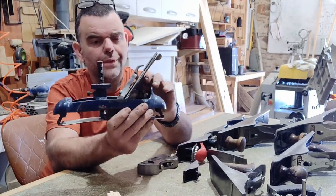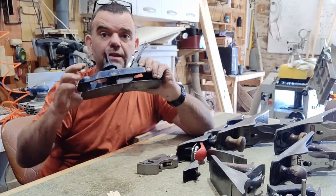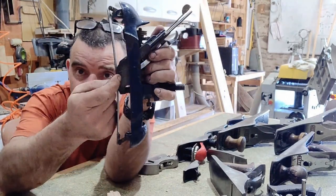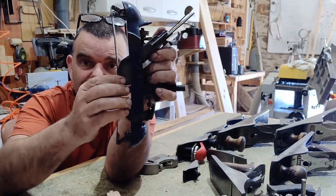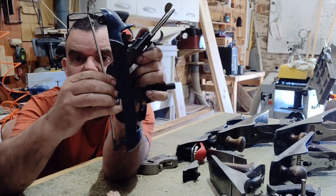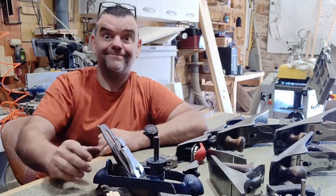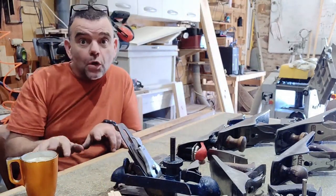You can still buy these new, but there aren't many models to choose from. There are quite a few floating about second-hand that need a little bit of renovation. The thing to watch out for on a second-hand one, if it's got a little bit rusty, is this part here — there's a sliding dovetail that must be allowed to move freely in either direction. It can be fairly tight, but it needs some movement to centralise the frog part of the plane. That is the Stanley compass plane. Don't forget to give us a thumbs up and subscribe, and comment below for any questions.